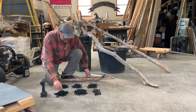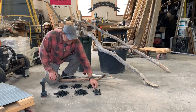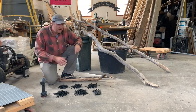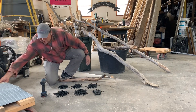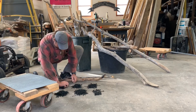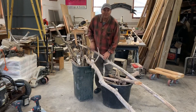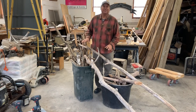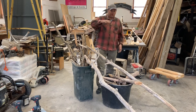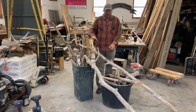I have multiple sizes here in the trim screws: an inch and five eighths, some two and a half inch, and some three inch. When we get into different sizes and start putting different sizes of wood together, we're gonna want to use different screws. Same thing with the sheetrock screws — I have some twos and also some two and a half. I do have a couple of these big timber screws that are black that we might use to secure some of the bigger pieces together. I'm gonna load up my tray with all these screws and then we're gonna get started building.